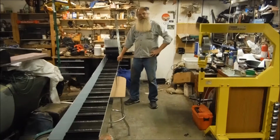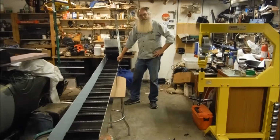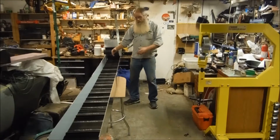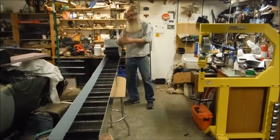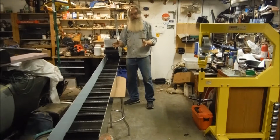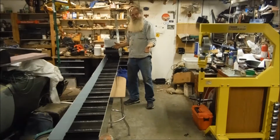Now, the guys have all recently gone over to those Hydroforce nozzles, and those Hydroforce nozzles are working really good on beach sands. The 4-inch Hydroforce nozzle is going to be a lot of water, and I've got that 13 horsepower pump, so it's pushing a lot of water. If I get a 60-40 mix of water and sand, that's a lot of material going across a 10-inch wide box. And with the gold separating, it takes a lot of tumbling before the gold finally breaks loose from the sands that we're having out there on the beach, these old mine tailings. So this is why the long toms seem to be working a little tiny bit better.